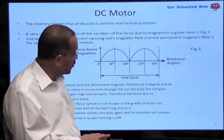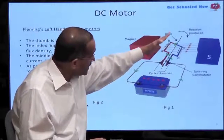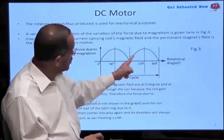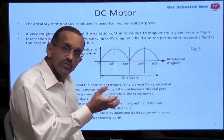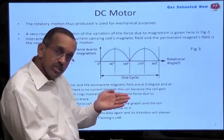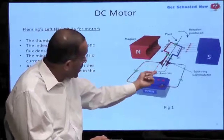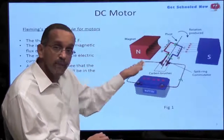Where is the force at maximum? The force is at maximum when the red part of the turn has completely turned and is parallel to the magnetic field. It continues to turn, the force decreases, and eventually goes to zero when the commutator rings reach that point. I started at 90 degrees to begin with maximum force. As the commutator continues to turn back to its initial starting point, the force begins to increase again — when this coil is parallel to the magnetic field.